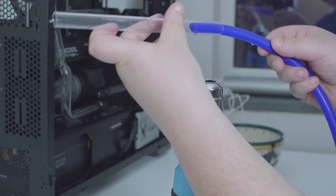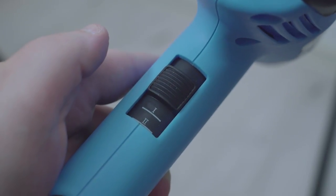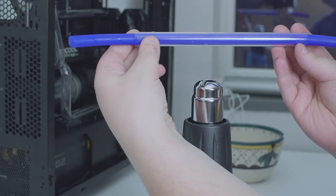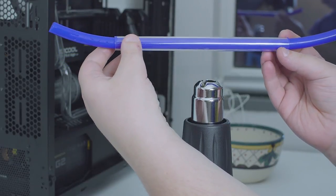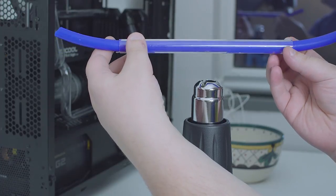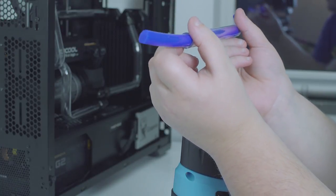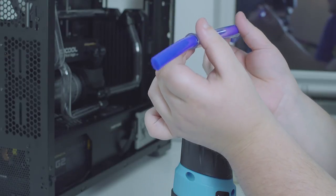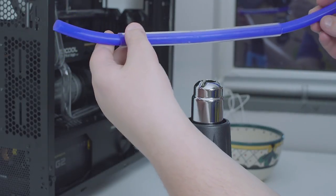So how about bending some tubes? I'm going to explain exactly how I did it as a beginner. You really need to get a feel for this, so I recommend you first experiment with a few pieces of tubing. I'm placing the tube around 3 inches above the heat gun set to level 2, or 450°C. The idea is to uniformly heat up the tube where you want the bend to be and the adjacent areas. Don't get the tube too close to the nozzle or you will burn it, and don't keep it too far away or it will take ages to heat up. Tube behavior really depends on the brand — it takes anywhere from 1 minute to 1.5 minutes to reach the desired temperature. Make sure to rotate and move the tubing left and right constantly. Be patient and don't force it; you will know when it's getting close to the bending point since it will start warping.